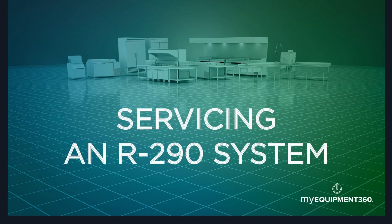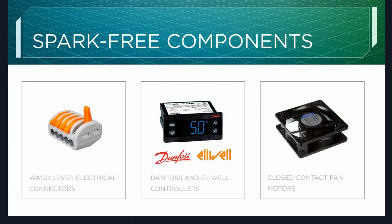Servicing an R-290 system. Here's some examples of some spark-free components. On the bottom left, that's essentially just a fancy wire nut. Wago lever connections, and it's really just a fancy wire nut.